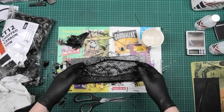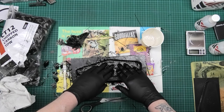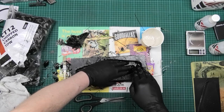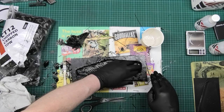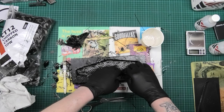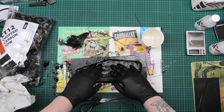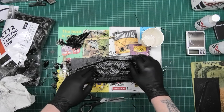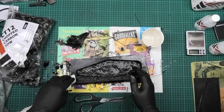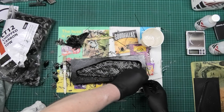I'm ready to put the piston part in. I'm a bit worried - this is getting hot, it shouldn't be getting that hot. I mean this is infusion resin, I've put 50% fast and 50% slow hardener in, but it is getting really hot and I'm worried that I didn't make this mold very thick.